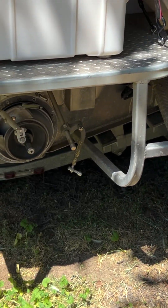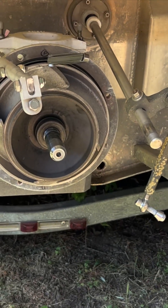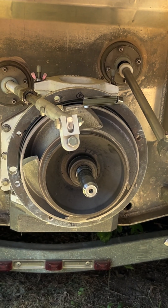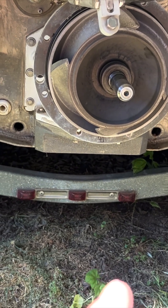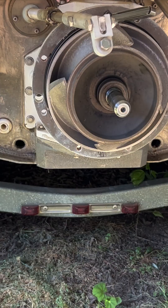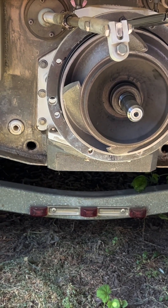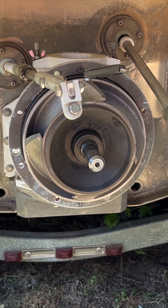I was looking on the internet for some guidance on checking the impeller. I've sucked a lot of rock through this unit over the years learning how to navigate the river, and this is the first time I pulled it apart. I've noticed it's low on power, it's slower to come out of the hole. I got under, pulled the grate, and by hand filed the impeller because it had a bunch of rock gashes on the leading edge — that creates turbulence, air pockets, and you lose power.